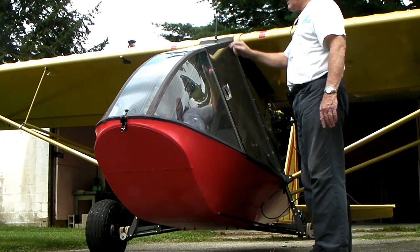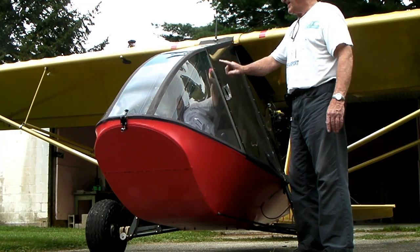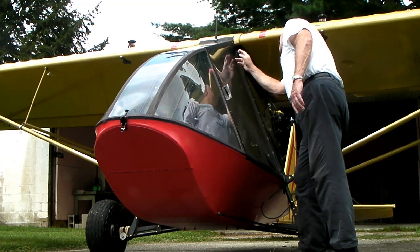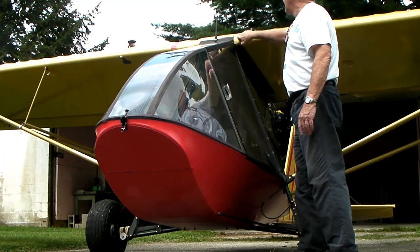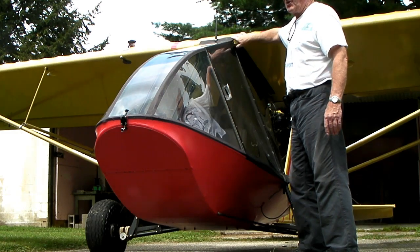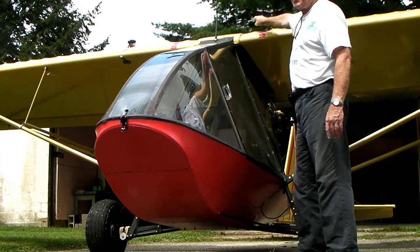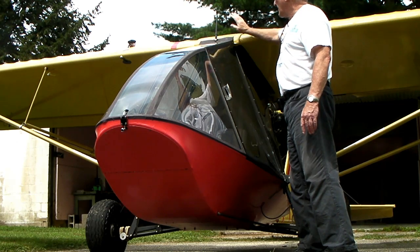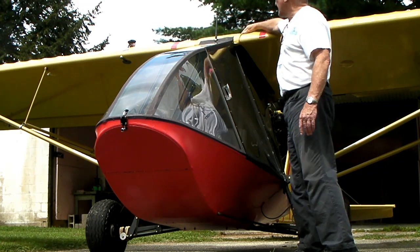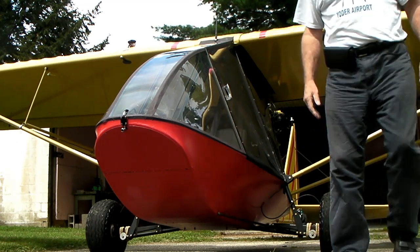This piece has been replaced, probably the last time I took this cover off. I put it on permanently with some aircraft hinges. To take this off, the first thing I need to do is remove screws behind here that go through eyelets holding this on. I changed the original system to a tapped hole with a screw. There are two on the leading edge and two on the trailing edge of this cover. Then I can pull this cover back, as it's held along the sides with Velcro.